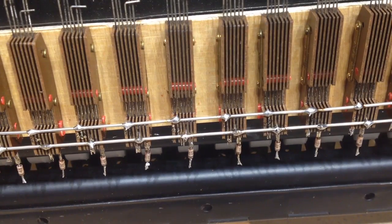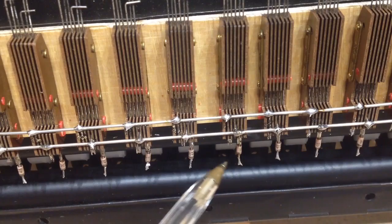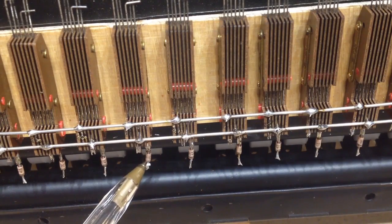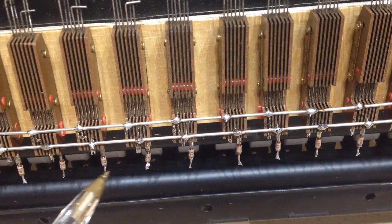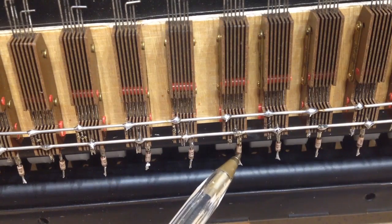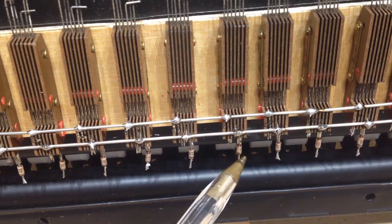The bottom keyboard already has some diodes attached to the keys, and we can see these along the bottom here quite clearly as we looked at earlier. We can just about see on the video that the black band is in fact at the bottom. These are all facing away from the keys. It does look a bit confusing in the picture because it looks black at the top end as well, but there's actually a band around the bottom.